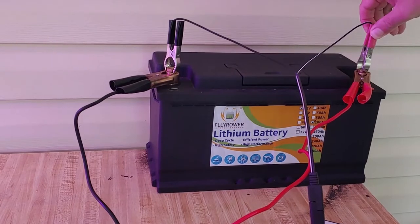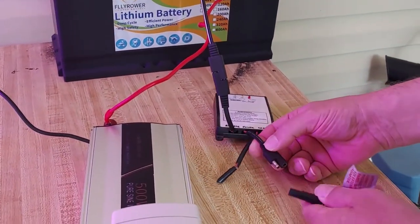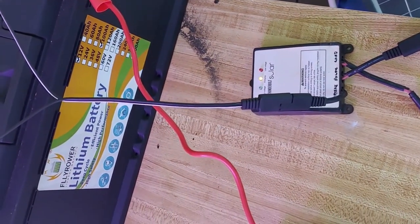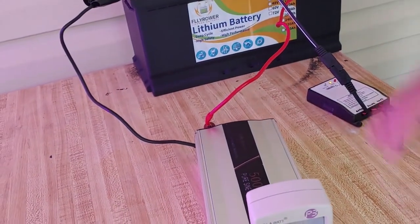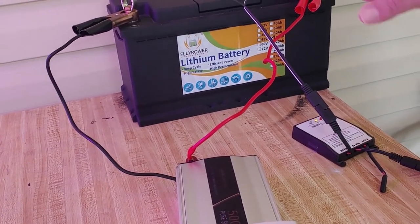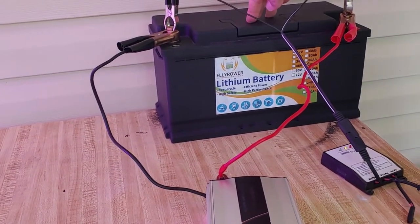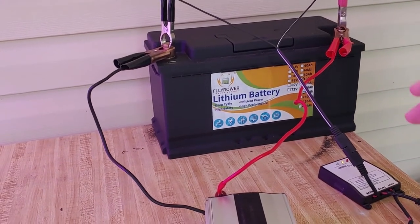Positive and negative — always do the battery first. Then the wire that connects to my solar panels right here — I'll hook that up. And as you can see, the yellow light is on and it is charging. So as long as I leave it like this, while it's running all my lights and the pump and keeping everything going, it will also keep the battery charged up. This way I get a good indication of how many panels and how much solar power I'm going to need to recharge this battery that's running the farm over there. That's just a little tip — I do this a lot, putting the little charge controller right on top of the battery to see how much the battery will take to get charged up.